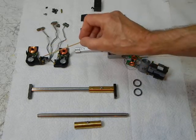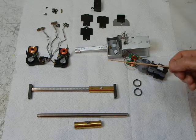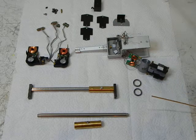These are slot-type photo interrupters that interface with the slit plate, which tell the microprocessor where the arm is laterally — left and right, in and out.